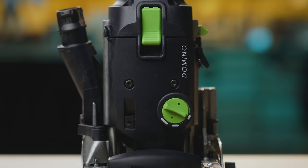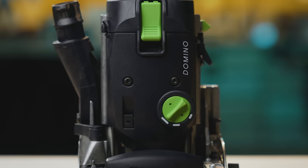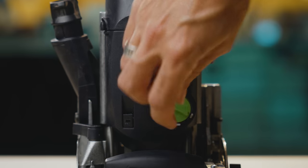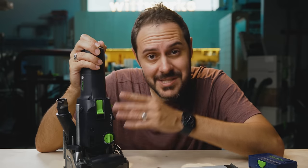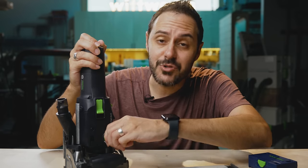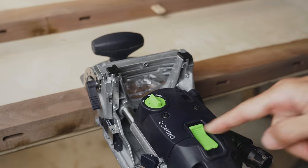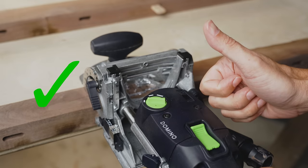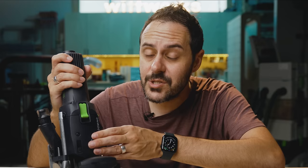This first knob is the width of your mortise. Most people will probably use it on the tight setting. There's also a medium and a wide setting. The first mistake to avoid: never change the width when the machine is off. There are transmission gears inside, and many Dominos have been sent back to Festool for repair because people jammed this and destroyed the gears. So make sure you change the width when the machine is on. The bigger 700 model — I don't think it matters — but for this one, always change width with the motor running.